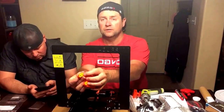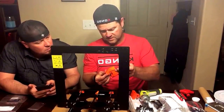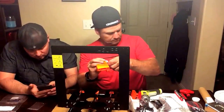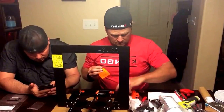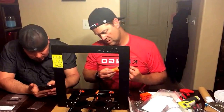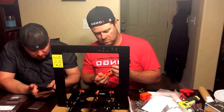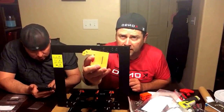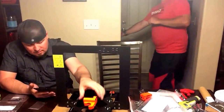Okay, so you're gonna push a square nut into that little slot. Then you're gonna use the Phillips or the flathead to seat the bolt, and use an 18. So insert the screw, tighten the screw until the head almost reaches the surface of the printed part. We will adjust the final position later. Make sure the M3 by 18 screw is not visible in the hole. All right, so you want your screw sitting right about like that. So that's the hole you're not supposed to see it in.